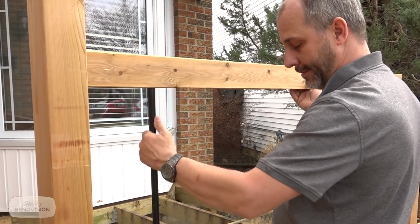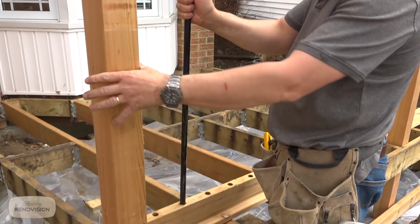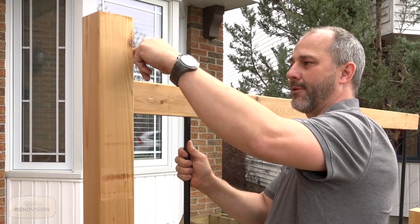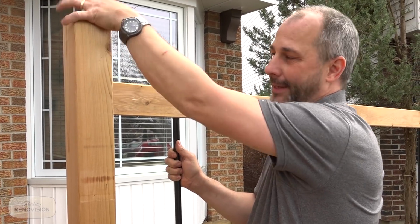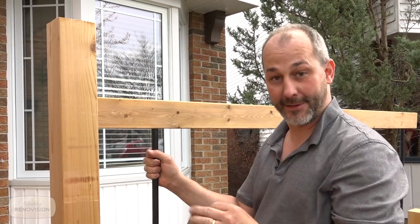This is basically the height of that railing plus an inch, because you want to keep a gap down there so that things stay nice and dry. Then there's another 2x4 and then a 5/4 board. That leaves us with almost 3 inches of stub, which is perfect for the LED cap. Usually those lights only sit about an inch over the top. And that'll just give everything a nice, clean, intentional look.